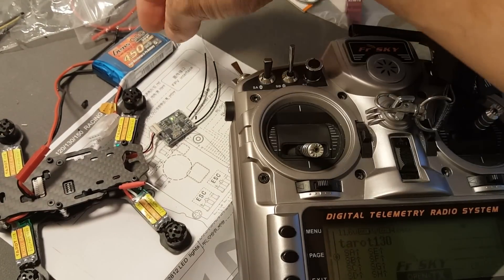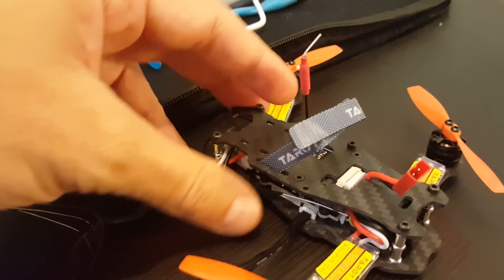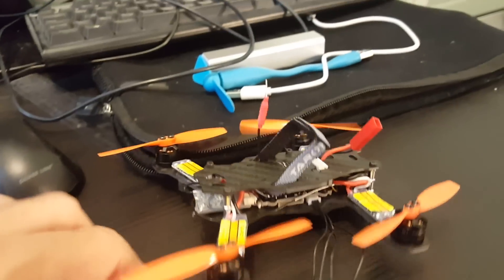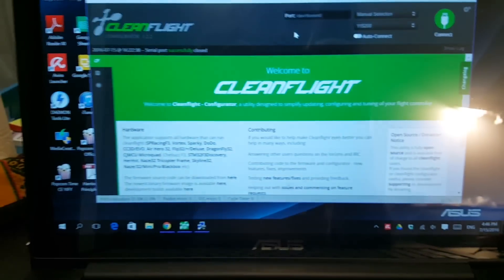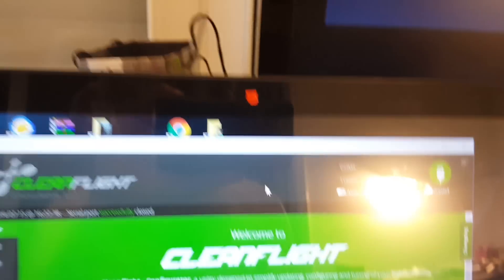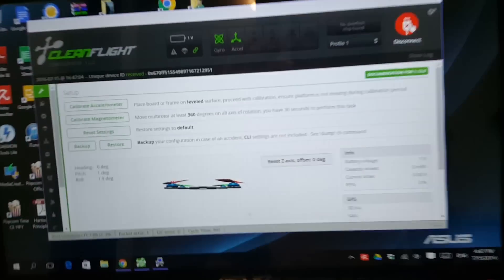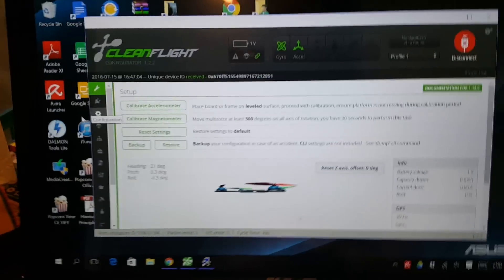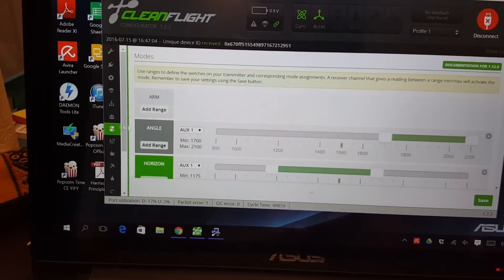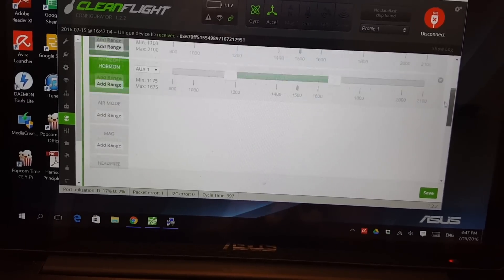Now that I'm done, it's already working. I can arm the quad and it's already working. The next thing I'm going to do is configure it with CleanFlight. As you can see, I had to remove these two screws in order to get to the USB port, and then I just connect it to the supplied USB adapter. I already have CleanFlight installed on my computer, and I had to install a driver which I'm going to put in the description. Now it's going to connect. You can just go through the settings and put all the required information — it already comes pre-configured to SBUS. Next I'm going to add a couple of flight modes and then just fly this thing.